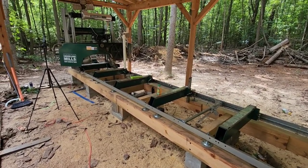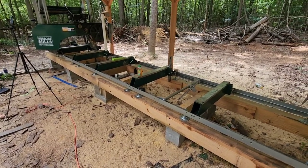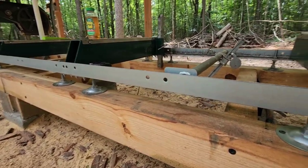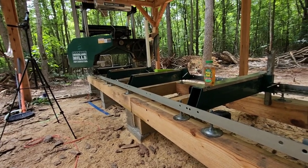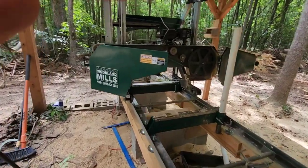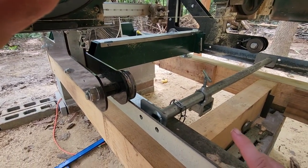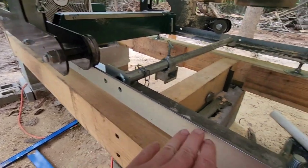I mentioned making adjustments on your bandsaw. When I built this shed I came out here, dug footers, laid block, cut beams, and set my mill on top so it would never move. At the one-year review, it hasn't moved a bit. These mills come standard with adjustment feet so you can fine-tune the up and downs. If you're having trouble with your cant being a little bit out of level, always start from the bottom of the mill and work your way up. Start at the base — check your track first. Remember the blade and the mill is going to follow whatever the track is doing. If you've got a dip in the track, the blade is going to do the same thing in the log. Pull a line — I'll pull a roll of twine down through there to see if it's level. If that checks out, see if your wheels have debris in them.